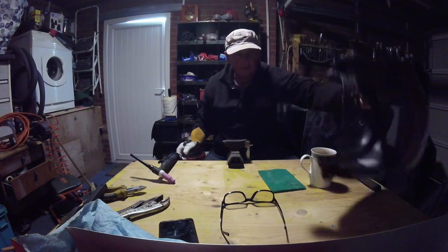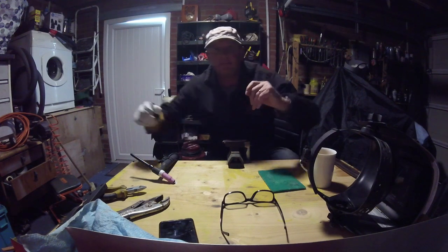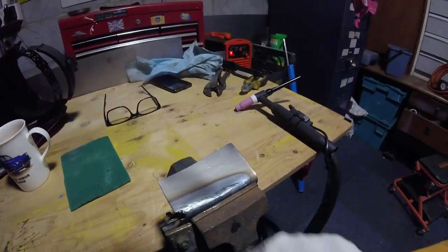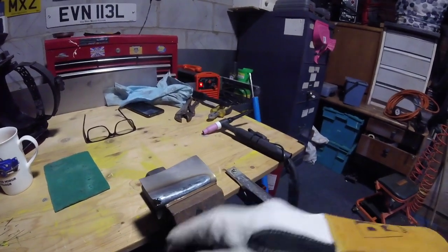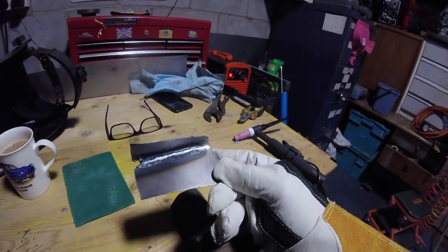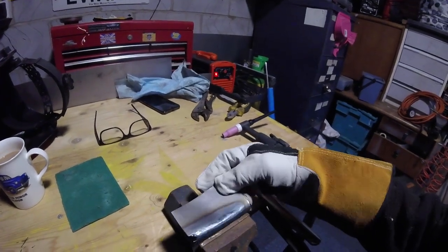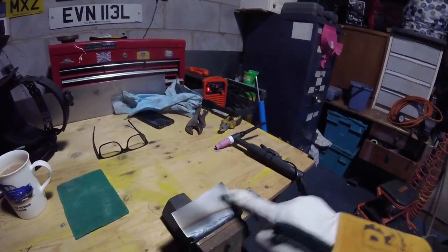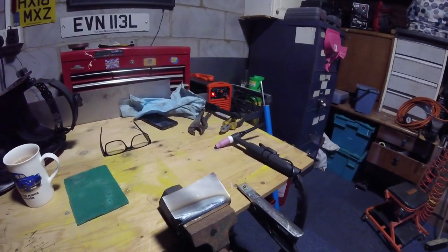Let's have a look. Because I'm not actually welding anything together, it's all over the place — I'm not very steady anyway with my welding. Let's have a look at the other side. Yeah, it's got penetration now, look — plenty of heat. Let's see if I can turn it down just a little bit more. Obviously the plate is quite hot now, so I'll wait a few minutes, turn it down just a touch and try again.